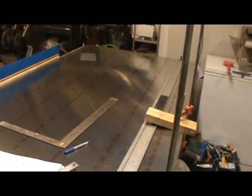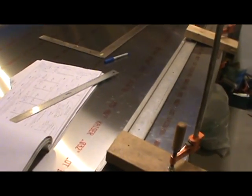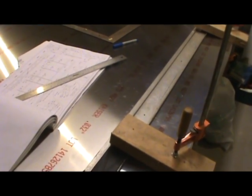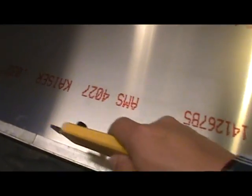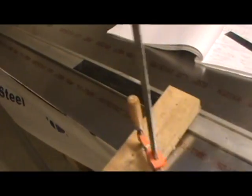I was going to climb up onto the table and do this, but because I'm right-handed, I would have to cut starting at that end and then bring my way down here. The way that cutting with a scoring knife works, it's better to actually cut here and draw towards you with the short side towards your body. So I think I can actually stand here and cut it.